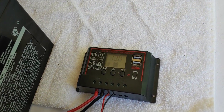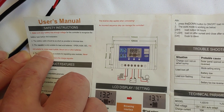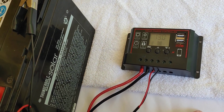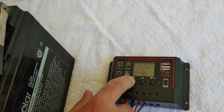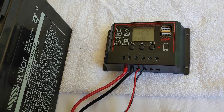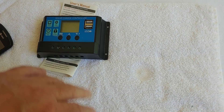These little ones specifically say in the manual: do not use for lithium batteries — not suitable for nickel hydride, lithium ion, and other such batteries. A lot of people do use them because you can program it for whatever charge is needed for a lithium battery, like normally 14.6. Right now I have this set at 14.1, because that's what I charge my AGM batteries with. But you must be careful — these are cheap charge controllers. I use them, but only when I can keep an eye on them. I never leave them alone for too long or let them charge for a long time when I'm not watching.